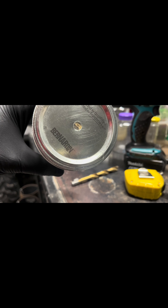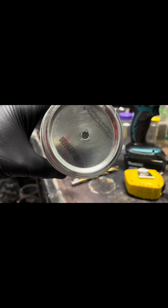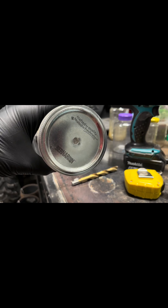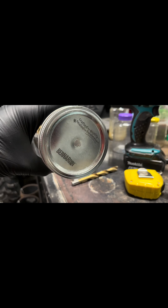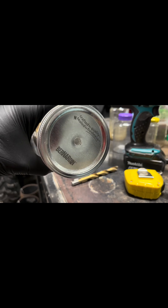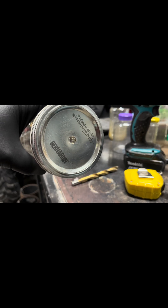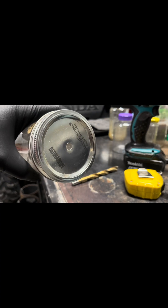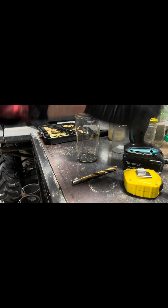Here's how it looked at 21/64ths. Actually, I'm going to take this right to three-eighths. If this is what your ratio looks like, that's actually quite a bit too small. The reason I'm going to step up a little bit more before I even attempt to run this: when the hole is this small compared to the jar, if you get the air-fuel ratio just right inside and the hole isn't big enough, there's going to be a huge spike in pressure as soon as you get ignition. That's when it risks being dangerous — you could really blow the jar out. So I'm going to go up one size.